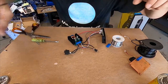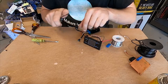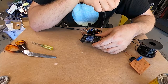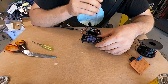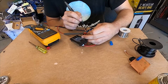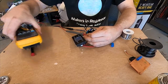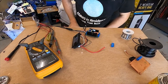I've stuck it all together now, so I'm going to check if it's going to turn on. I'll keep this one separate and plug in the power here and turn it on. What we've got to do is adjust one of these trimmers until the voltage is at 3 volts, because that's what we need for our plating. It's sitting at 3 now, so I'll grab my multimeter. It's working — showing 6.5 amps which is a bit much, but I should be able to tune that down. Now it's at 3.1 — that's pretty good.